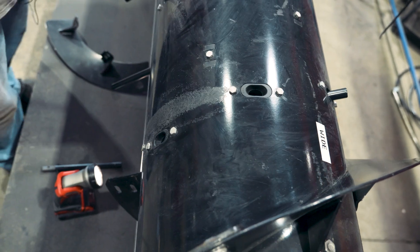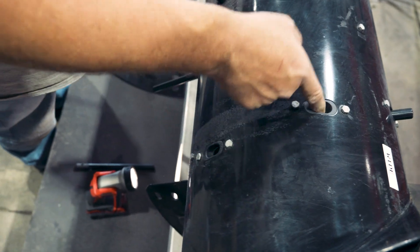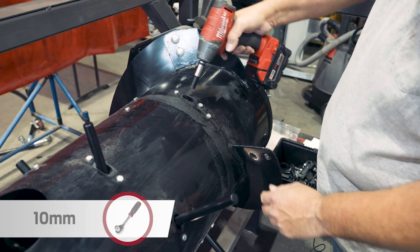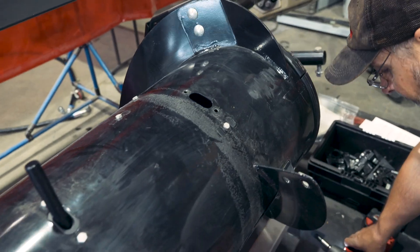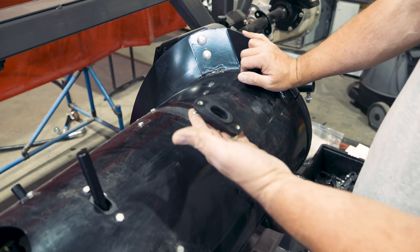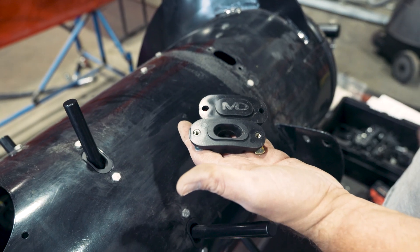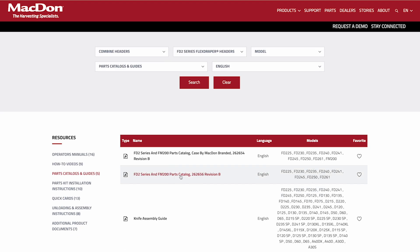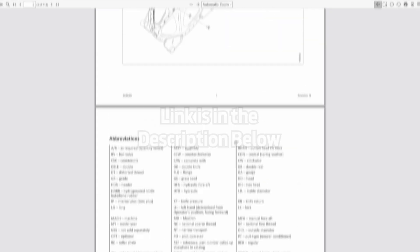When we rotate over, you can see we've now got a couple of finger guides with no fingers in them. We need to install plugs in here, otherwise we're going to get a lot of debris inside the auger. To remove the finger guide and install the plug, you're going to need a 10mm socket. There is our finger guide, and we are going to replace it with a solid plug. You can acquire all this stuff from Macdon parts — follow the link in the description to the parts catalog for FD2 Flex Drapers and FM200 Float Modules at macdon.com.